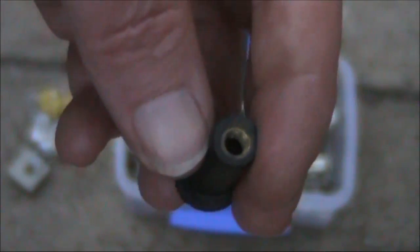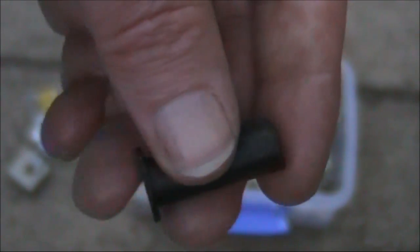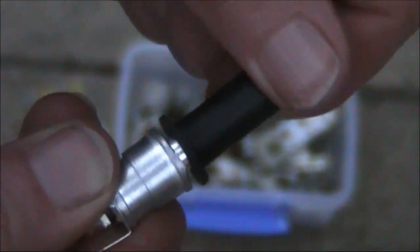Not a capacitor, but this is something I got from a hardware shop. It's got a thread to accept a screw and it's a bit of rubber. The significance here is that you can fit them on a beehive trimmer and adjust it without touching the metal — that could be useful for some applications like magnetic loop antennas.